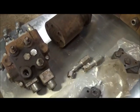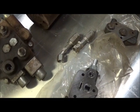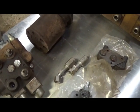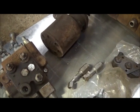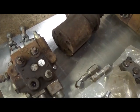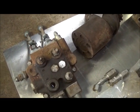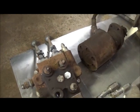The control valves we are going to use are Prince SV valves. They're actually rated at a maximum of 16 gallons per minute. You've got to go with more gallons per minute on your control valve than what your pump puts out, and you can go as high above that as you want. If you've got a 12-gallon-per-minute pump and you go with a 20-gallon-per-minute control valve, there's not a problem with that. If you go below it, you start creating heat — it'll create more pressure, but any time you're choking down on a line you're going to get more heat. It's hard on the system. You'd never want to go with a 12-gallon-per-minute pump and a 10-gallon-per-minute control valve. Always go above your pump rating.